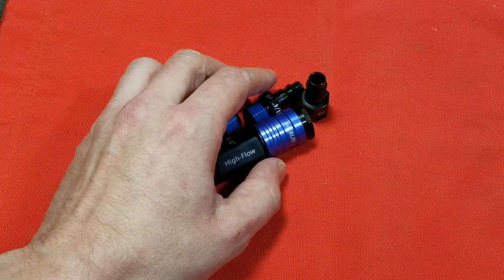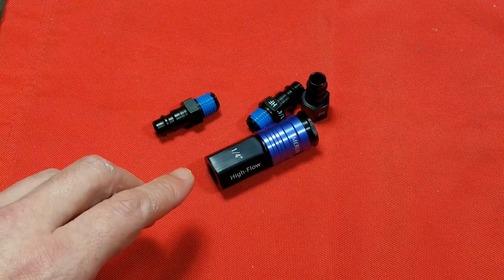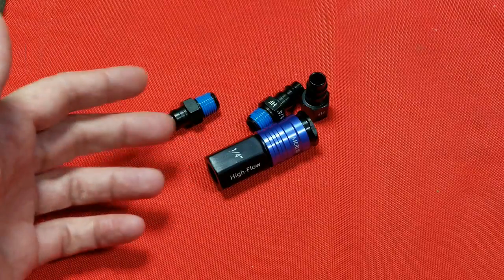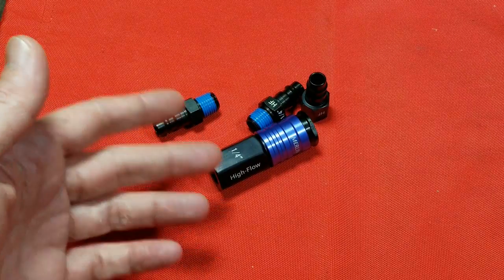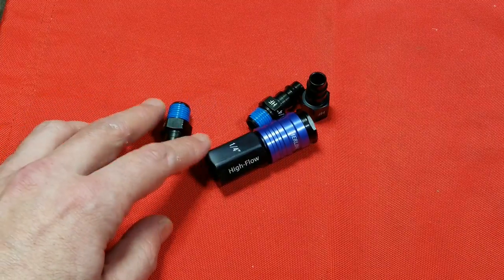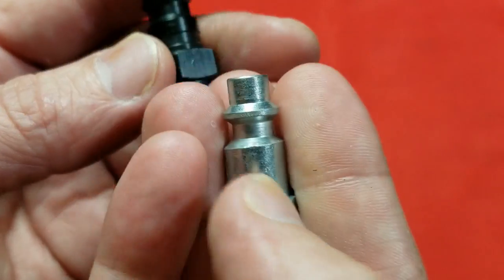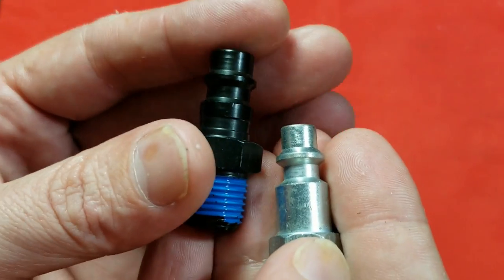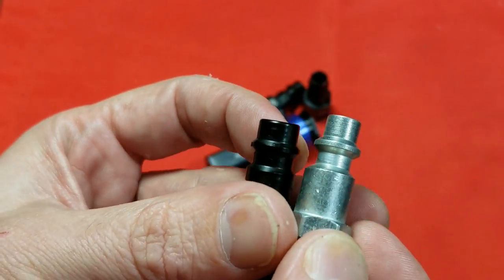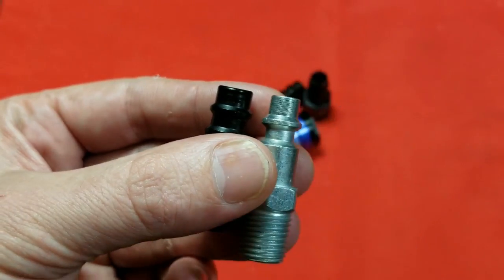It really was like a marketing boon and now there are all these knock-offs that are physically compatible with those Miltons. But these are a proprietary standard. They don't fit the industrial standard, they don't fit the automotive Parker standard air fittings — those are the two most common styles. These types of air fittings that have the noses on them are known as V-Groove or industrial slash Milton. These quarter-inch high flows have just slightly different dimensions and so they are not compatible with traditional high-flow couplers.